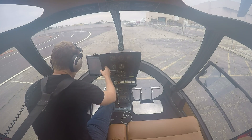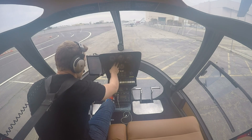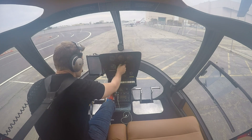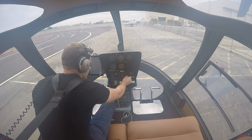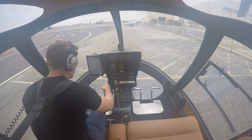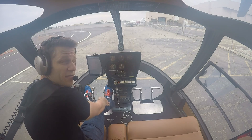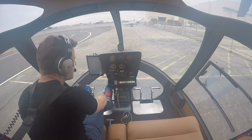Radio master is on — should be off, but it's on so you can hear me. Lamp test — here's the clutch disengage and the overboost check light. Altimeter set to 60 — that's where we are in Long Beach, 60 feet above sea level. Clock — match the red hands, which is helpful for knowing how much fuel you used. You can use an average consumption rate per hour. This Enstrom goes about 15 to 16 gallons an hour, so if I've flown an hour, I know I've used about 15 to 16 gallons.